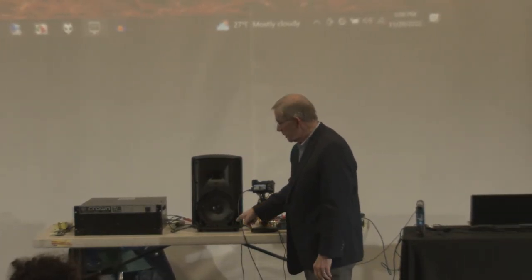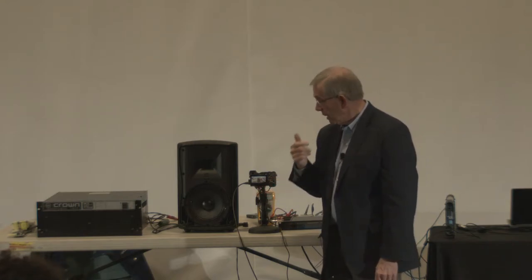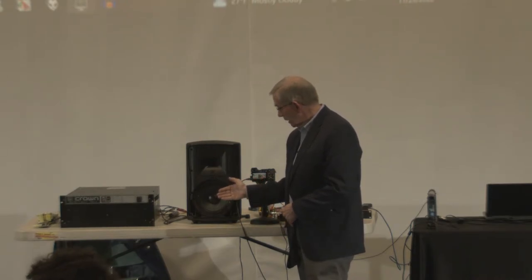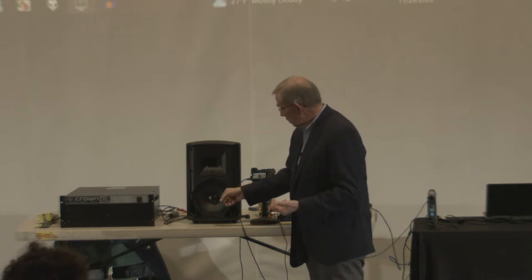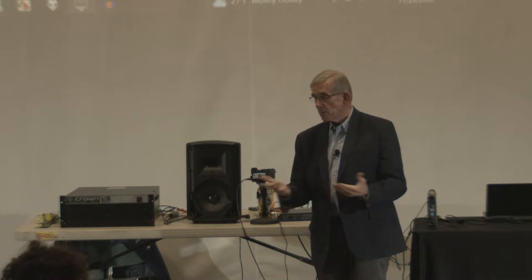So did you say something about, if we use a passive speaker, the signal distortion isn't there in the same way? Yeah, what I'm saying is that in a speaker like this, what draws all of the current and what makes the amplifier clip is the low frequencies. It's not the high frequencies. Typically, it could be if you get into a feedback or something of that nature. And so if you feed this speaker enough to get some level out of it, and you've got a good balance between low and high, what's going to clip the amplifier is the low frequency portion of that. But what I'm saying is that when the amplifier clips, you get high frequencies also into the woofer, but they're passively low passed. And so you're not hearing that clipping noise out of the woofer, you're only hearing it out of the high frequency.